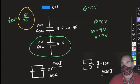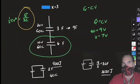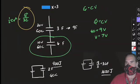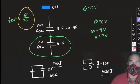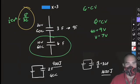But this is not the way to do it. Even though it sounds like it is, with the capacitor, there are a lot of reasons why this would be the absolute worst way to try and create physical work from electrical energy. One of them is you have to have an exposed capacitor. And the amount of force we're talking about here is not very much. So we don't actually move things around using electric fields like this. There are much better ways to move things around. Not to mention the fact that in order to move this around, you have to have the dielectric already halfway inserted. You'll just be pushing it out a little bit more or pulling it in a little bit more. But it's not effective because of what you have to do to the rest of the circuit.